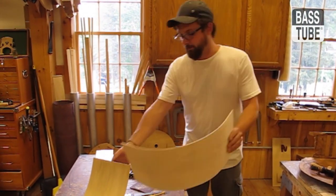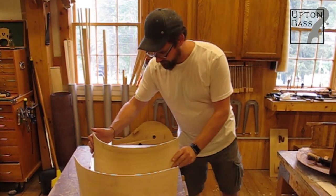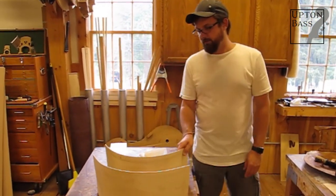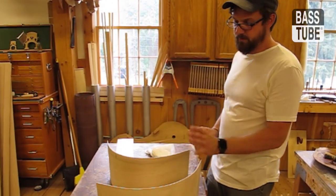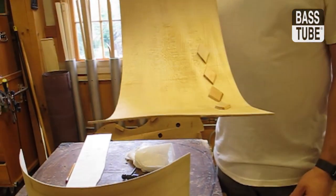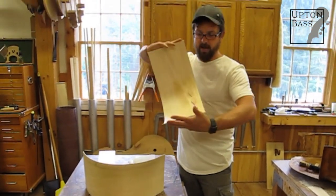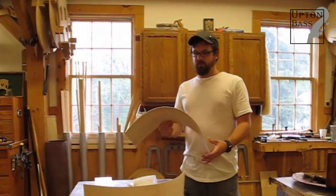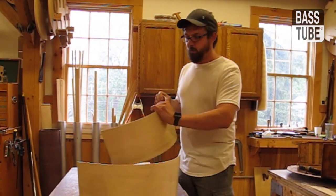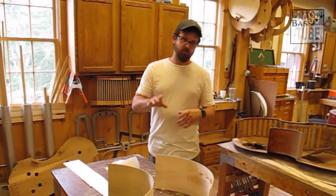You'd have to go back in the video and compare — it's probably debatable. But we love the resonance of this, and we love the stability of this. The probability of these three pieces of wood working together as a team versus this single piece — you can actually see there's already some deflection in this piece of wood that, yes, would be halted if it were glued to a corner block, end block, linings, a top and a back. But the concept is this guy is set in space and time, generally this shape, for a very long time. We are not saying that one is better than the other.